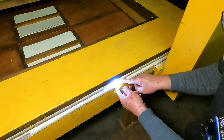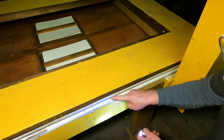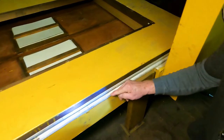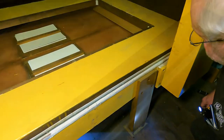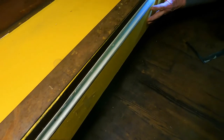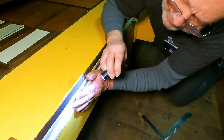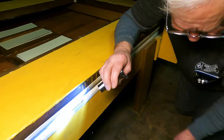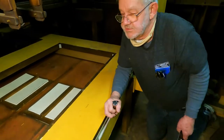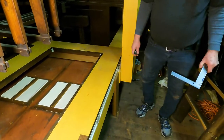And the splitting, as you see on the side leather, some of that can be a result of the fact that as it closes, it's forcing this part here, the rib down here, to open up like that at the edge, and that starts the cracking. Because this rib down here is actually a fair amount inside, and up here it isn't. It's less. So that would indicate a little bit of difference. It's easy to allow for it and correct the situation when we rebuild it.